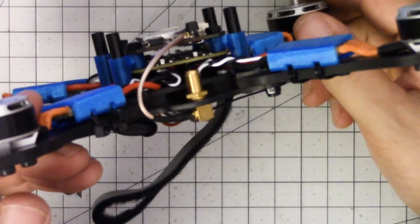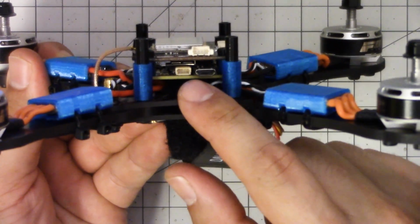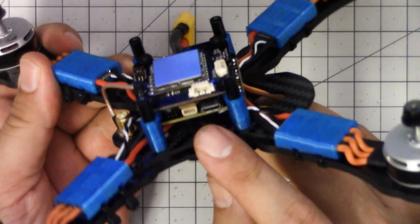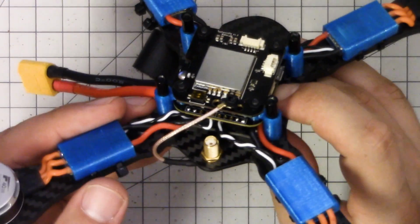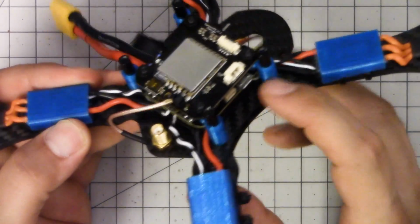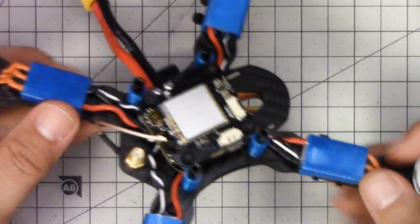It is a really nice clean build. I like the way Moto designs his flight controllers, with all through holes, even the ESC and the power wires. And then the way he typically builds them and recommends they be built is that the wires come up from the bottom and then are soldered from the top. It really does just make for a really nice clean wiring, clean build.